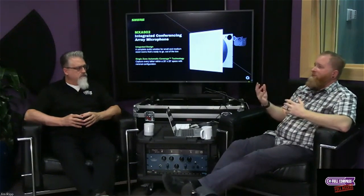With all of these microphones, that's why we reach out to help with these designs. A lot of times in conference rooms, you'll justify the microphone more towards the display, especially if it's a predominantly video conferencing room. You're facing the display, so you justify that mic towards the display physically, but then I can steer my zone back out in the room to cover that conference room table that might be in the middle of the room.